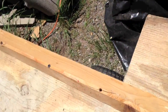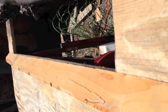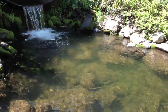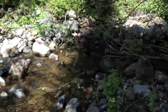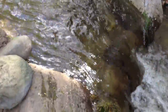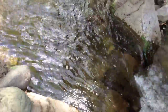I've just constructed a weir to put in the creek to measure how much water there is. The water will go over the edge, I'll measure the height here, and then I'll measure the height back from there and be able to determine on the basis of the distance how much water is going through the creek. This is a culvert where the creek crosses underneath the road — it would be a great place to measure water flow, except there's another source that comes off the top and meets this creek down below before it meets my property. I found a good spot to place the weir because almost all the water is through this one little channel here, so I'm going to mount the weir from here to here and measure the amount of water flowing through.